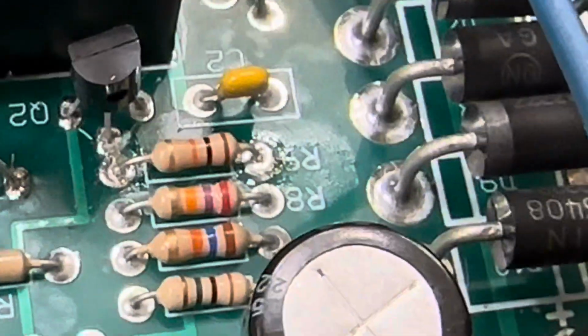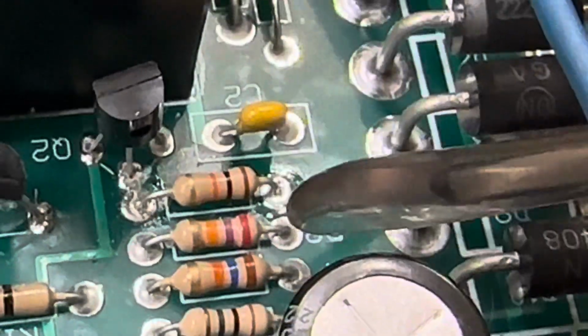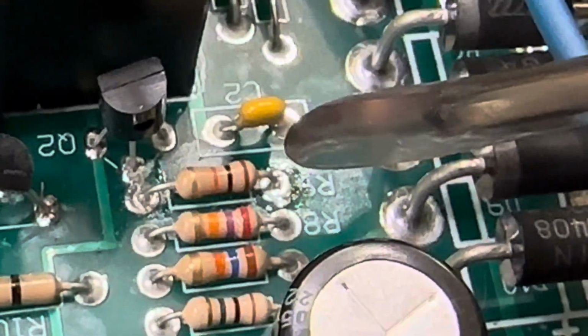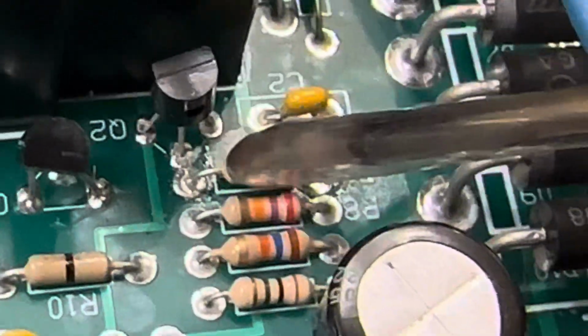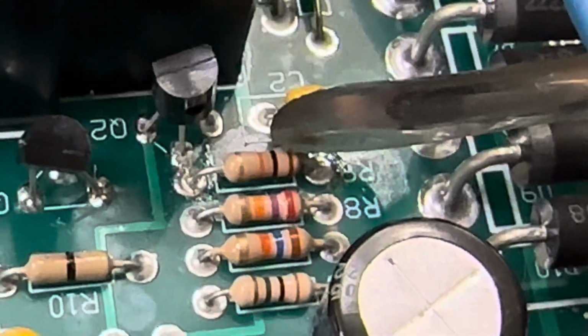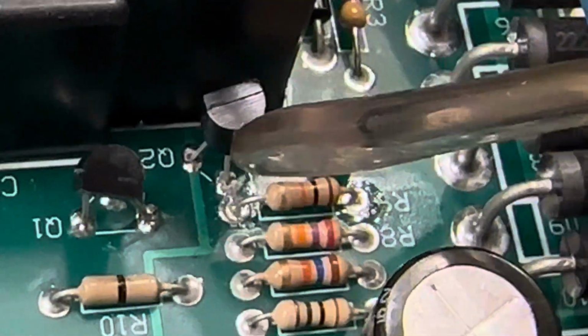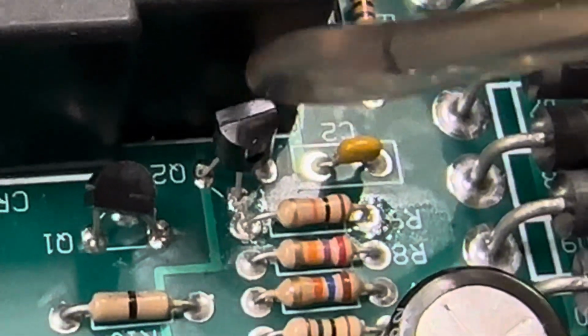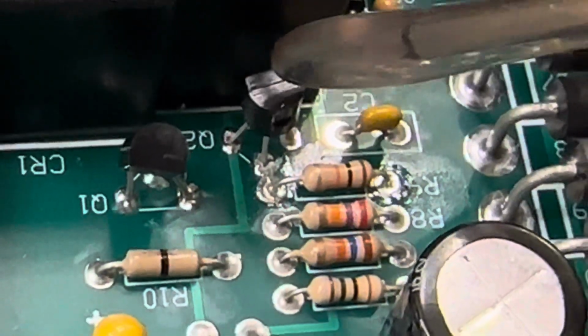So let me try and point to that resistor here. There. Right there it says R9. You see the R9 there, it's upside down, but anyway, R9 was gone. That's a 10K, so get a 10K resistor in there. If that's gone, I think it blows this guy up, the Q2, which is a silicon controlled rectifier. So you might need a Q2.